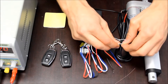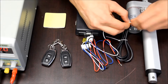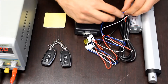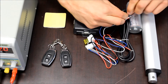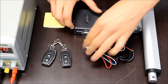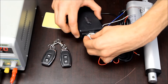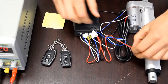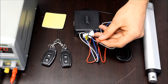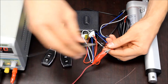To wire the PA31, you take the white wire from the control box and connect it to the red wire of the actuator. Then you take the blue wire and connect it to the black wire of the actuator. Then you take the wiring harness and plug it into the control box. Then you take the red and black wire and apply power — the red wire takes 12 volts and the black wire you attach to ground.